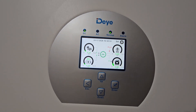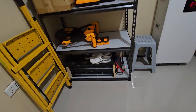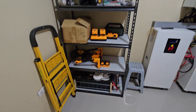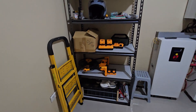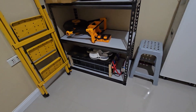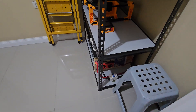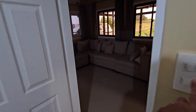We're at 98% still with 1.1 kilowatts coming in, the house is using two, and the grid is off. We've got 30 kilowatts of factory-made batteries, and then I made one that's 15 kilowatt. I'm going to use this shelving unit to fill all these shelves — that'll be 75 kilowatts total. I find it's cheaper and I have more control making my own battery. I've got a Daly BMS, 250 amp, which is way overkill.